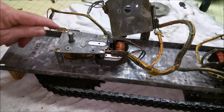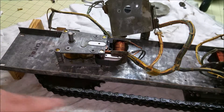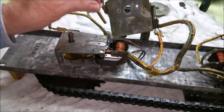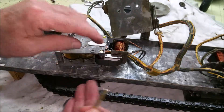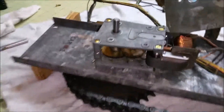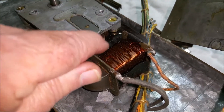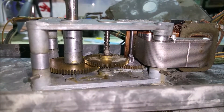Here's the motor assembled. Like I said, I used screws and the old rivets, which is a rather laborious and really tricky undertaking, but it saved me having to disassemble all this timing mechanism down here. Most likely you're going to be able to pull this motor straight off of whatever mechanism you're taking it off of. They send you the new rivets to put in, and that would probably be the best way to do it. Or if you can get the motor all the way off, it's easy to put a pass-through bolt with a nut on the other end. So there's the new rotor — it's free up and down and it rotates. And here is the gear mechanism.